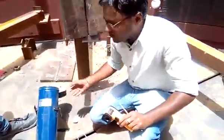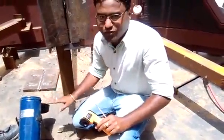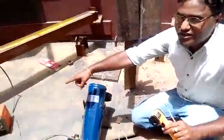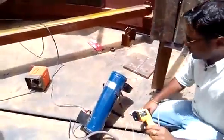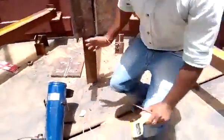This has reached our welding performance specification pre-heating temperature level. We also have the baked electrodes here — we have baked them in the mother oven and are bringing them to the site. Here we have the remote control of the welding machine. Now I'll ask my welder to start the welding and I'll show you the welding.